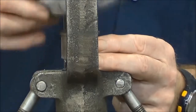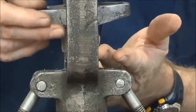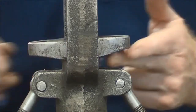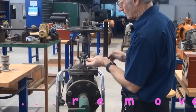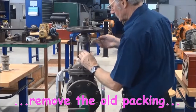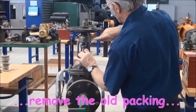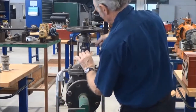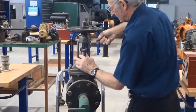You can get many types of valves that have just a one-piece gland on them where the bridge and bush are all combined. Using the packing extractor here, just lift the bridge and the bush out of the way, slide that down into the stuffing box, twist the T-handle and the corkscrew end will find its way into the packing. Then you just pull on the T-handle and it should come out through the throat of the gland.